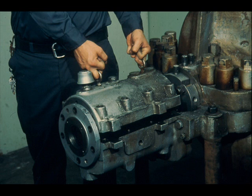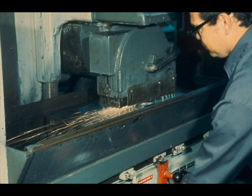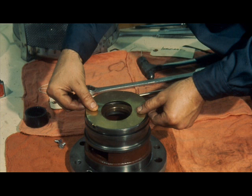To correct end play, remove the top half of the bearing housing and the oil pump bracket. If there is not enough end play, the bearing adjusting shim is too thick and will have to be machined to the correct dimension — this can be accomplished with a surface grinder or a lathe. If there is too much clearance, a thin shim of the correct thickness can be placed between the oil pump bracket and the bearing adjusting shim, or a thicker bearing adjusting shim can be made. You will have to evaluate the situation and make the decision. Your supervisor will be glad to help if you are in doubt.